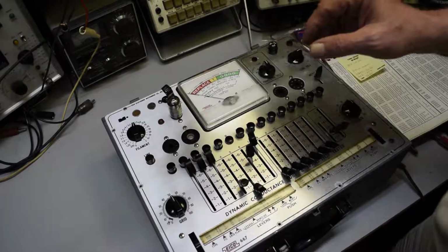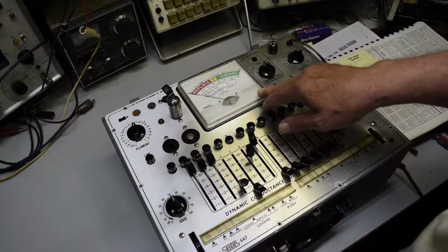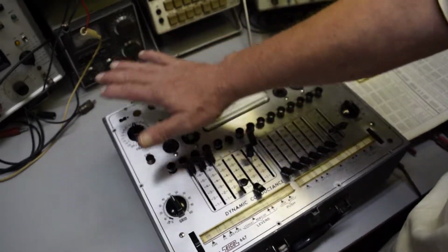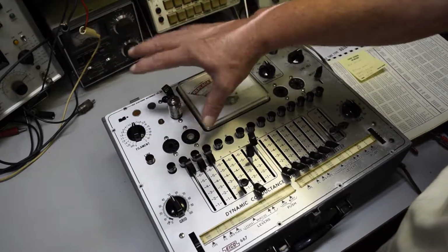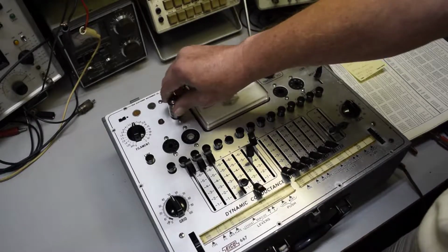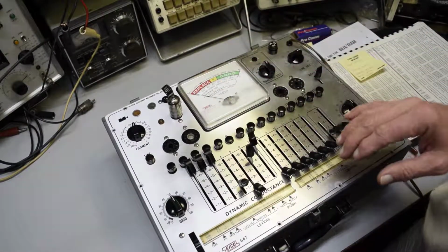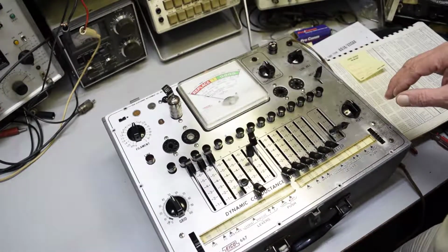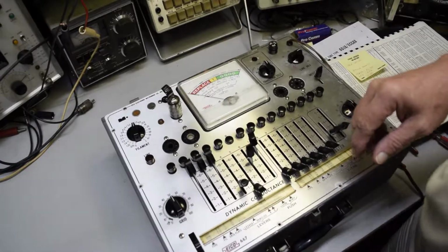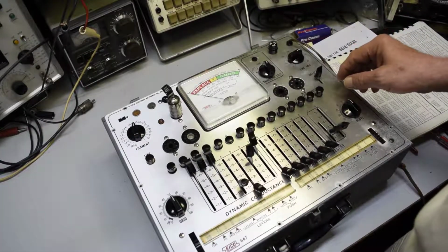It doesn't oscillate on my B&K 707. It did oscillate when I first had it. When I was first testing it, you could move your hand over it, and it would. You didn't have to touch it. You just bring your hand over, and that damn thing would jump all over the place. Tube socket's good and tight now. Before it would just slip right in. So I'm glad I fixed that, because I'd hate to pay to have it shipped back to me and then fix it, so just go ahead and fix it right the first time. Because that wasn't giving me any trouble. I just noticed it, and I said, I better change that.